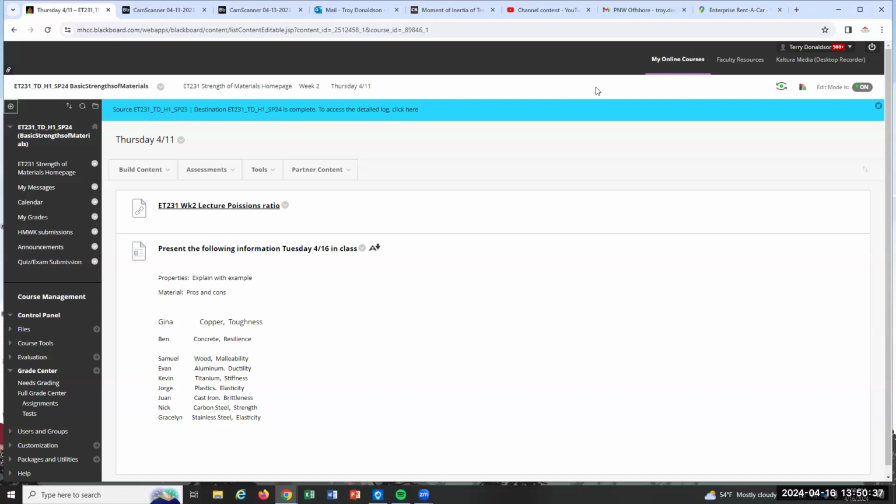Yeah. So the big thing is compression, right? Not tensile loading and definitely not bending. But trusses are all either in compression or tension. So if you can build it so everything's in compression, then cast iron looks great. It's no good at bending. Oops, I'm taking your thunder away. Sorry. Yeah, keep going. The big con of cast iron in general is that it's not good under any kind of tension. So you can take a piece of cast iron, there's a piece here, and you put enough force on it, it's just going to snap. Yep. It's not going to bend at all. Exactly right.